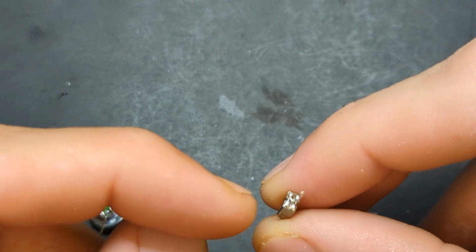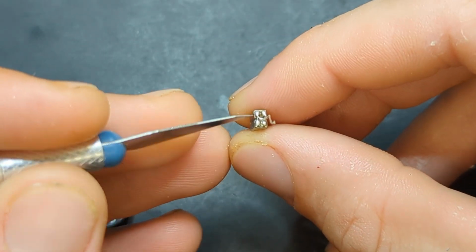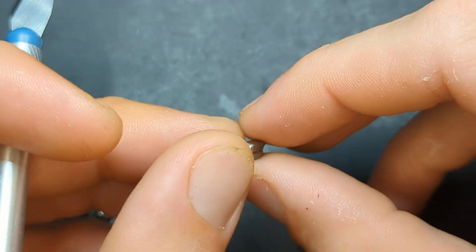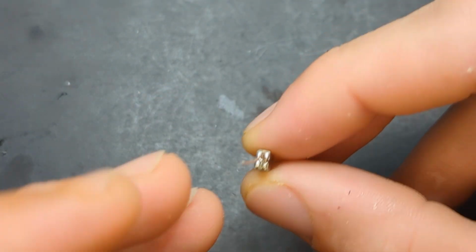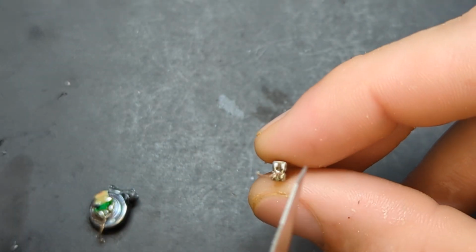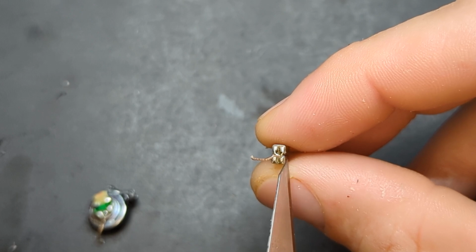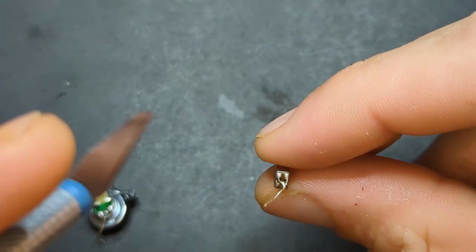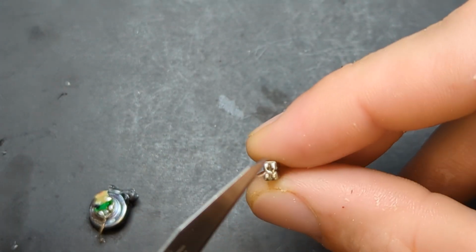When they go to wire them, it's not like you would see where they're kind of flipped, like on the 31736 or whatever, where the wires go diagonally. So for example, let's see. So yeah, this is the top side, okay? So this is the positive side. The right side is always the positive side on a balanced armature when viewing the top.